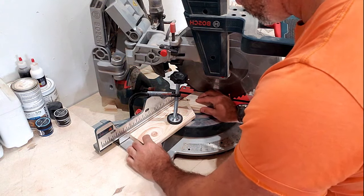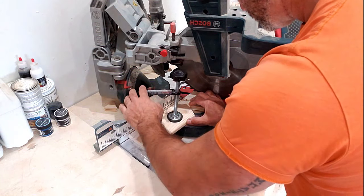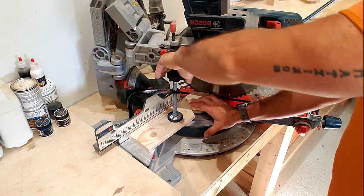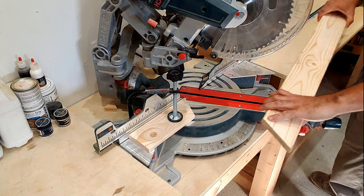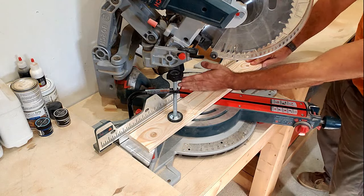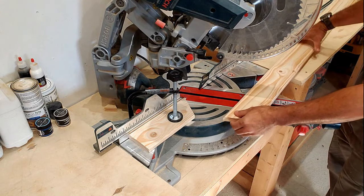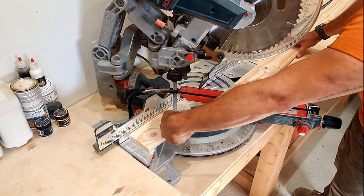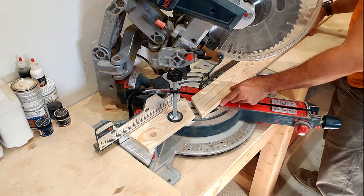The first thing I did was cut one of my spruce pieces off with enough length that I could actually clamp it down. Then I took my hexagon piece and measured the distance between that setup piece and the blade. Once I was happy with that I locked down my setup piece as tight as I possibly could. Since I was going to be cutting so many — for me it was a couple hundred — I needed to make sure this wasn't going to move. It's important that you get your off-cut piece at an opposite angle to what you're going to cut. You don't want the angles parallel because that'll make cutting your hexagons very difficult in the next process. If it's parallel just flip over your off-cut piece and that'll fix that.